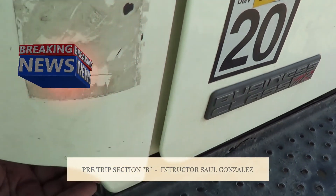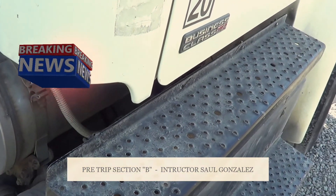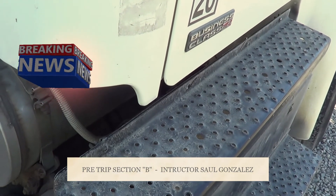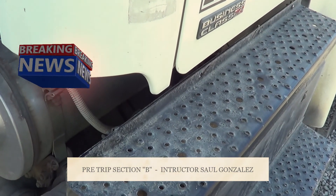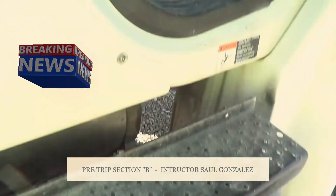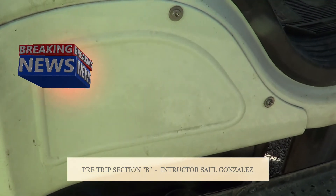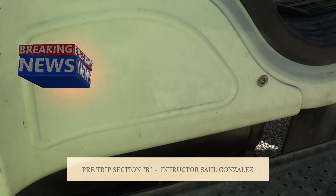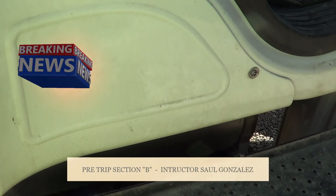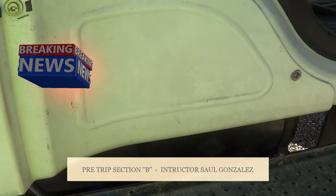Normally in the test trucks that we have, we have the windshield washer reservoir right here. My windshield washer reservoir — I'm going to make sure it's not cracked, broken or leaking, and it's securely mounted, no missing hardware. If I need to add fluid, you guys will find the cap right here. I will add it to the cap. The cap is in the locked position, it's not cracked, broken or leaking, and the rubber seal is not excessively worn or torn and it will not leak. My windshield washer reservoir is on the proper level.